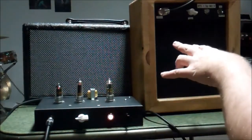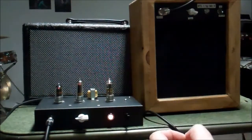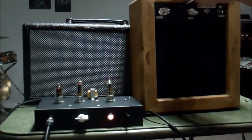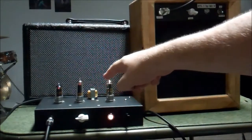This one does something a lot different than the RTL-1. If you haven't seen the RTL-1 video, that's okay — you can go back and look at it. The RTL-1 is a 12AX7 preamp, 50L6 power tube, and a 35Z5 rectifier. The power tube and the rectifier are octal — the big, fat, 8-pin jobs — 50s style. And this circuit, although modified by me, was inspired by a circuit from the 50s. This one was inspired by a circuit from the 60s.